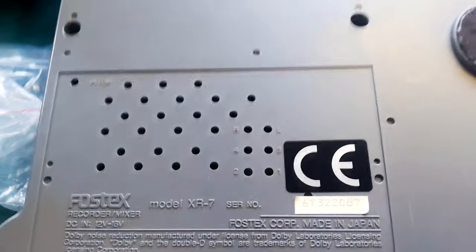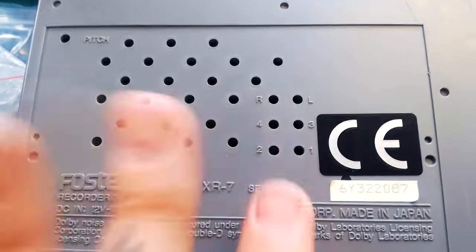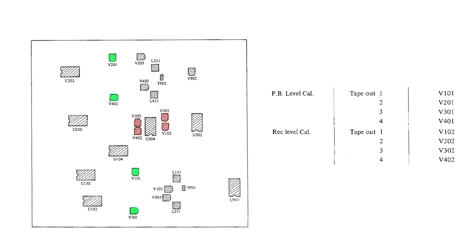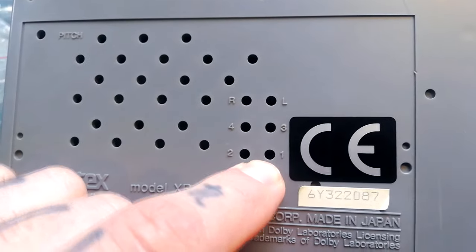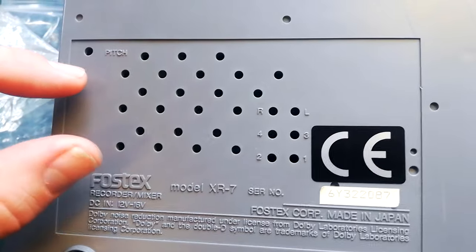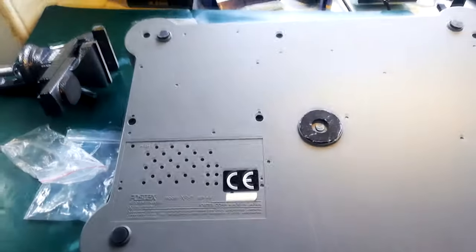As regards calibration: focusing on the main things you'd want to calibrate on the record/playback board, trimpots V101 through V104 are used to set the gain of the playback amplifiers; V201 through V204 are used to set the gain of the record amplifiers; there's a trimpot for the pitch of the tape player at the center notch of the user pitch control; and six trimpots pertain to setting the calibration of the meters. The trimpots for the meters are actually set in the back of the LCD screen module we looked at earlier, but they're accessible through holes in the bottom of the case.